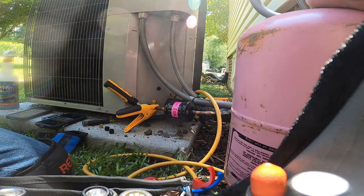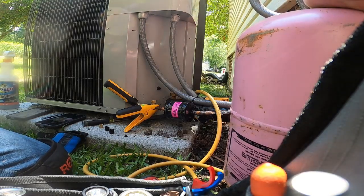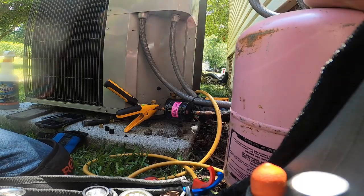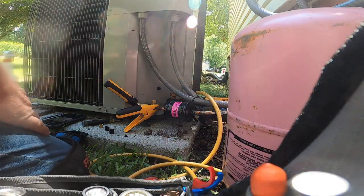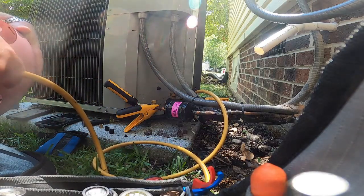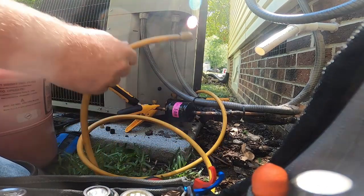This unit doesn't have a sub-cooling number on the outdoor unit. They don't put a sub-cooling number on this outdoor unit. It's got a factory charge of 6.6 — hold on — oh right here in real little print: 10-degree sub-cooling. Alright, I'm feeling that air getting warmer. We've gotten everything out of this one.